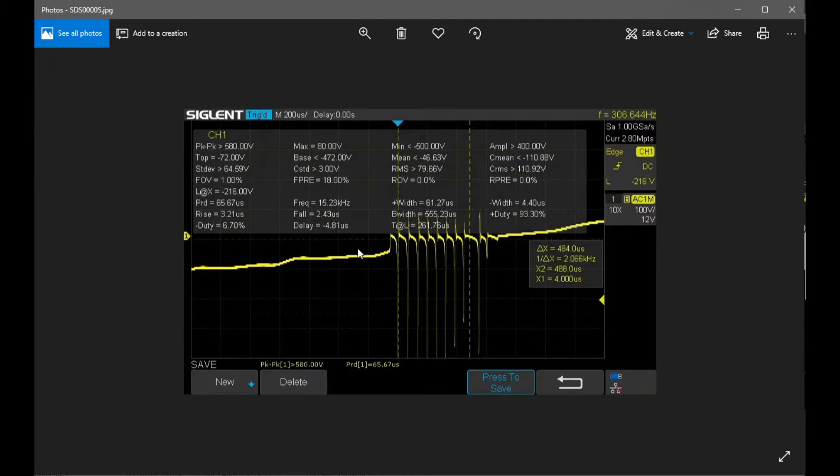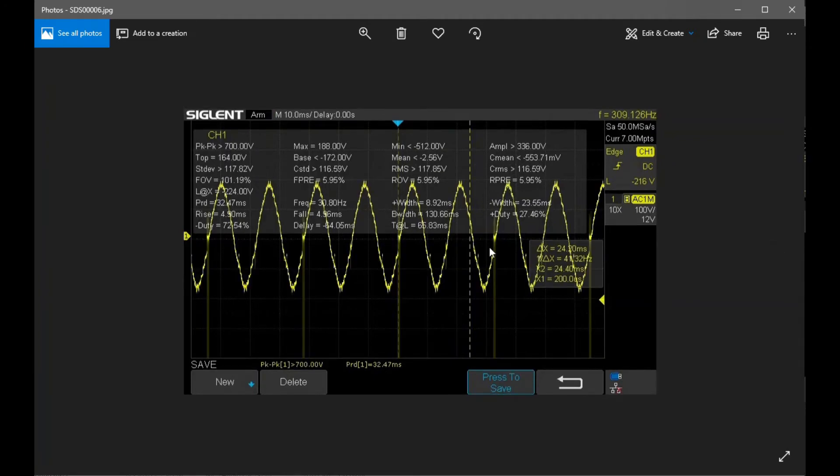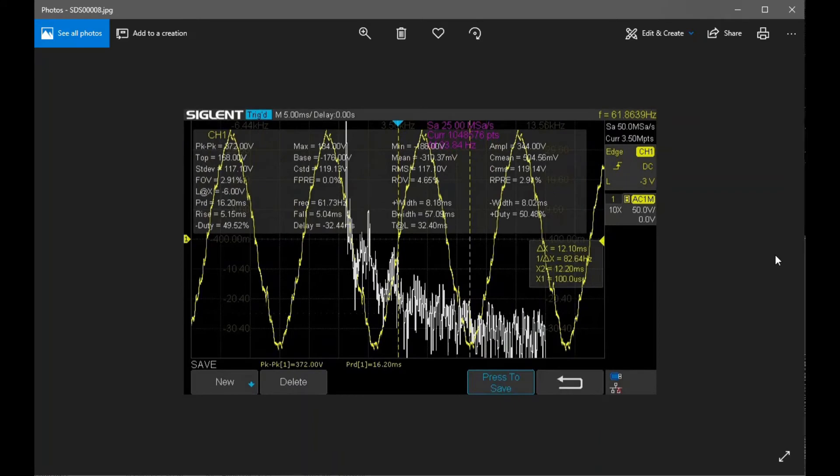Here's a zoom in on the defect — again, crossing the x-axis. You can see the waveform zooming down and coming back up repeatedly through each phase of the defect. I suspect that this was a problem with the AVR, because I ohmed the rotor windings, the stator windings — everything checked out okay. I replaced the AVR, and the waveform was zooming down with the whole waveform every three periods. After we replaced the AVR, this is the waveform now. There are a few harmonics — a harmonic here, here, here, and maybe here — but that defect across the x-axis is completely gone. Our frequency is 61.8 Hz, the RMS voltage is 117 V — big difference.